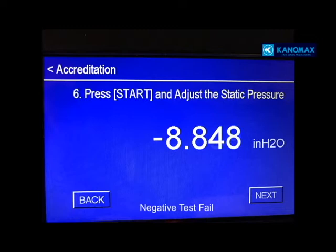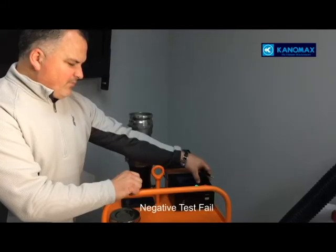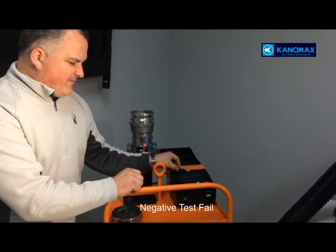We begin to start. We are not leaking within the first threshold, but we are leaking at the second — we have a fail. The results show: grid, US standard, class 48, same air leakage class, duct size, temperature, pressure, and static pressure inside the duct. We hit save and go from test 5 to 6.